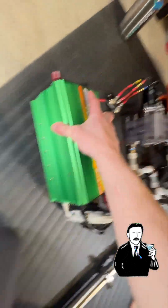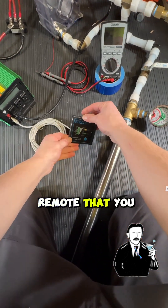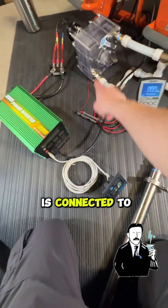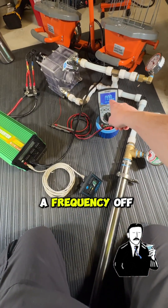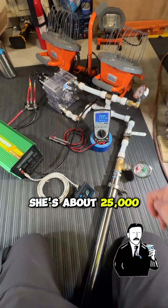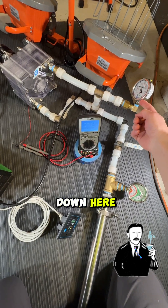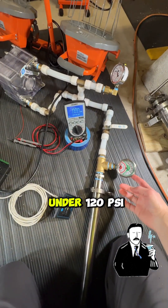There's nothing underneath it. It's got a remote that you have to use to turn it on. I've got a multimeter connected to the piezoelectric element just underneath the turbine — that picks up the vibration of the turbine, so you get a frequency off of this. You multiply by 60 to get the RPM; it'll be about 400 to 440 hertz, which is about 25,000 RPM. This gauge shows our nozzle pressure — zero, 10, 20, 30, maybe 40 at the top. This is the tank pressure; it's a little under 120 PSI.